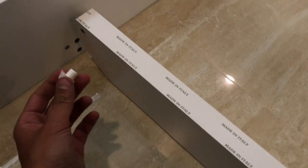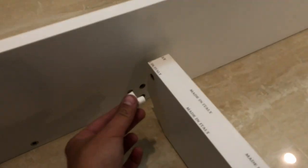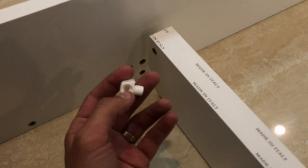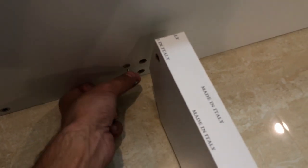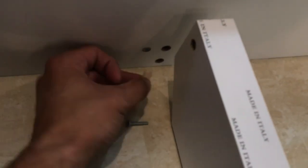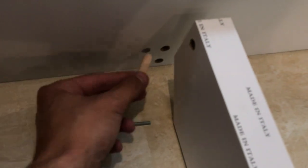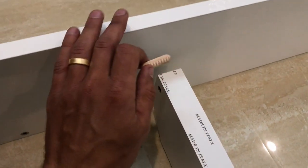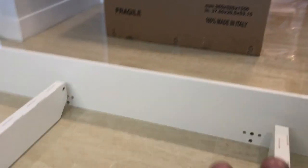Next is this. These are supplied here with each set, okay, like with all of the bolts. So you take this here, it will go inside, and then from the other side, there's going to be a special screw that will go here inside. And then into these two holes, you're going to put this piece of wood into the top and the bottom. What this does is allows you to align these frame rails to the side boards, and also to the footboard as well. And you're going to do this on all of the sides, everywhere.